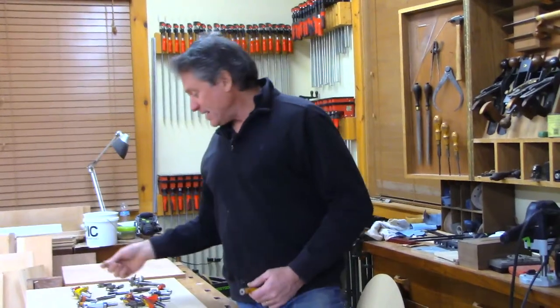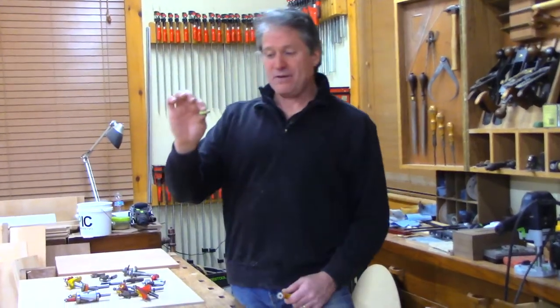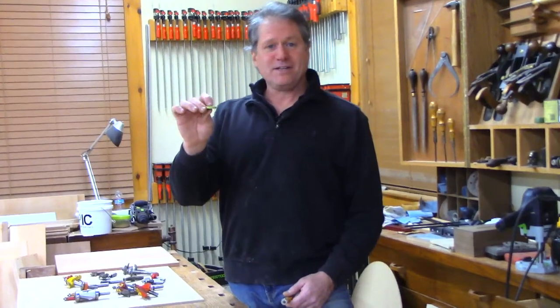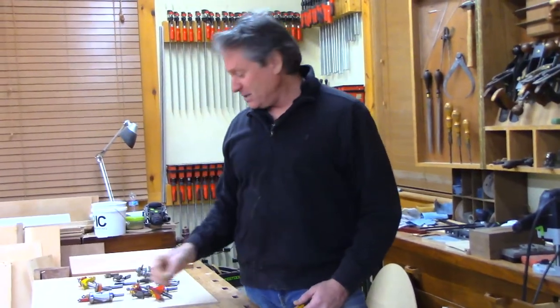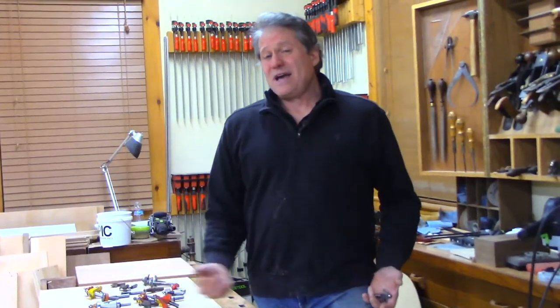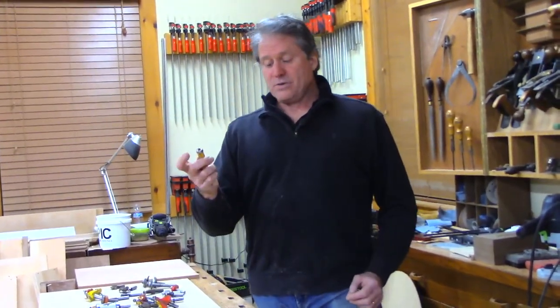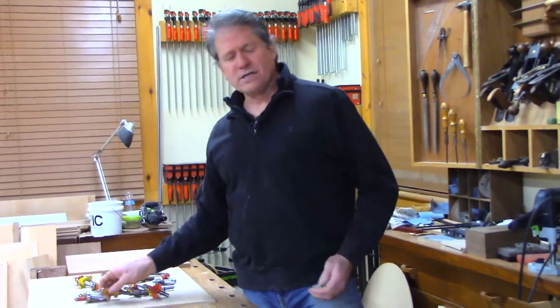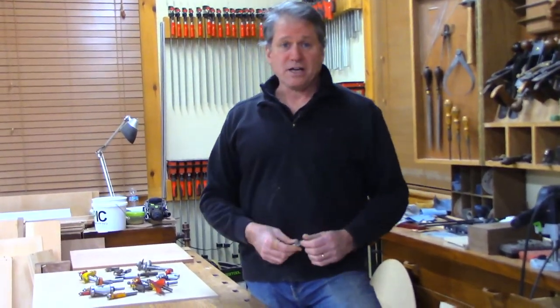You do sometimes get the line, especially with my taped bearing. That always grabbed a little more, and it definitely was burnishing the wood a little bit. But I've never found that to be a big problem, because I have to come back and clean it up and sand it anyway, and the bearing would never make a mark that was a problem to me, because it's not even cutting, really.